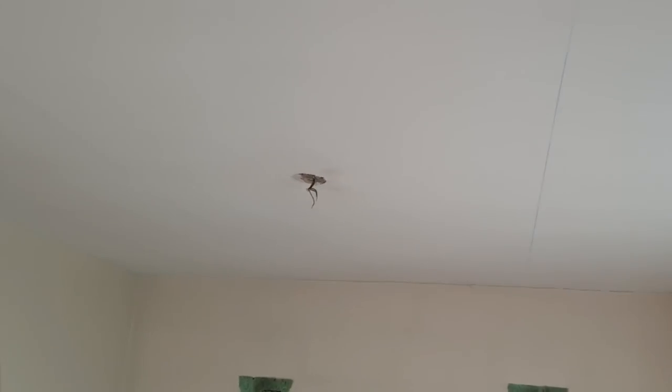If I ping a line and I discover there's a joist nearby, I can use this line to keep measuring off to my new location. And that goes throughout the whole thing. It's a lot easier to sort out a mistake once you've pinged these chalk lines on the ceiling than it is if you've got a laser. Plus, you'd need multiple lasers to do multiple lines. I'm going to have these two lines. I'm going to have a line down there, another line, and another line.